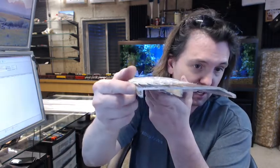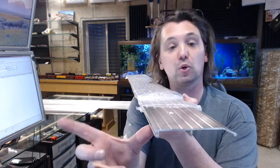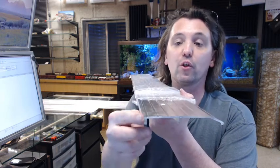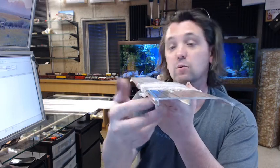This extrusion from National Guard with this sort of feature can be used for other purposes like building a thermal break threshold that might be very wide, et cetera. Seal material can be inserted into there, thermal break rigid plastic can be inserted into there, or in this case it would just be left empty.